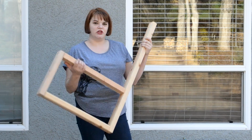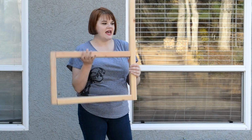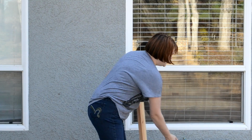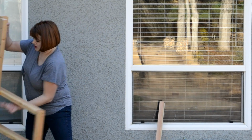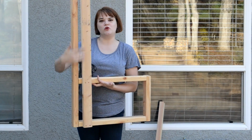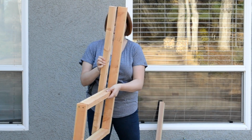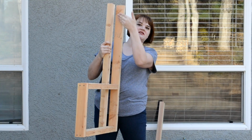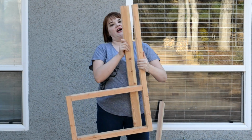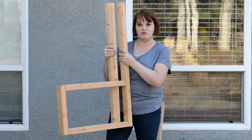And so when we get our frame up, it'll rest on here, and we'll screw the frame directly into these legs. So you need to build 6 of these little Ds, and then for the corner piece, you'll have to screw on one more 38-inch tall piece. And so what happens is when it sits like this, we'll have slats that come across that get screwed into this side, and then slats that come across that get screwed into this side. So this will be that corner brace.